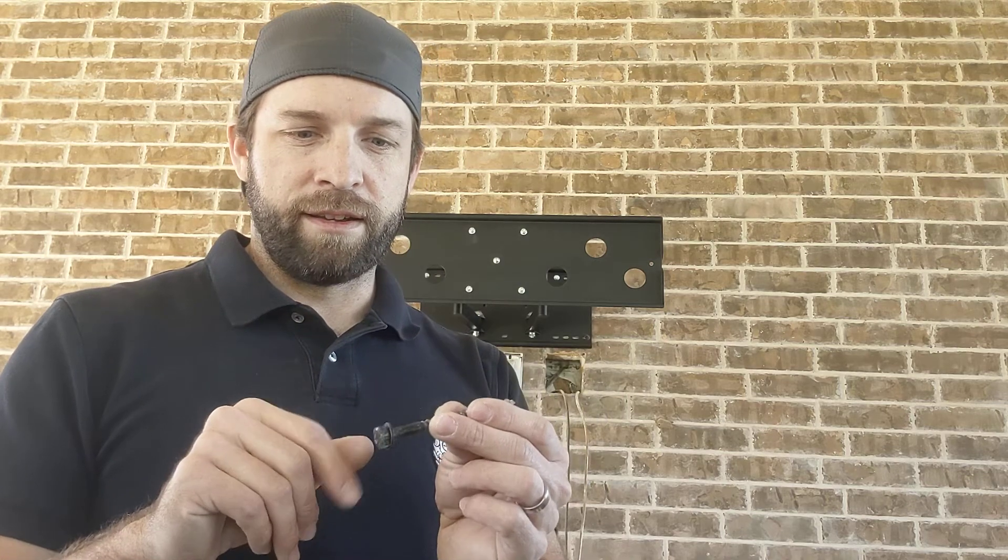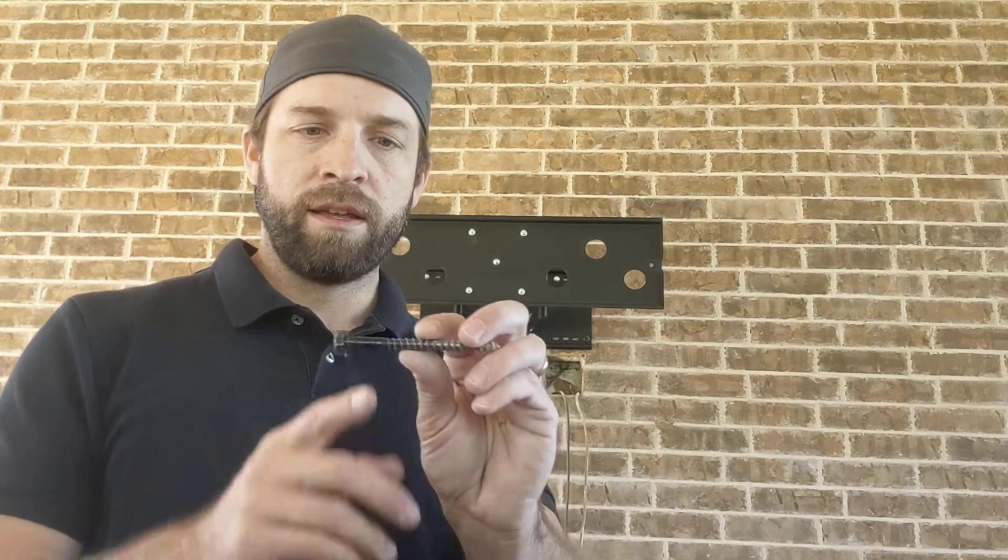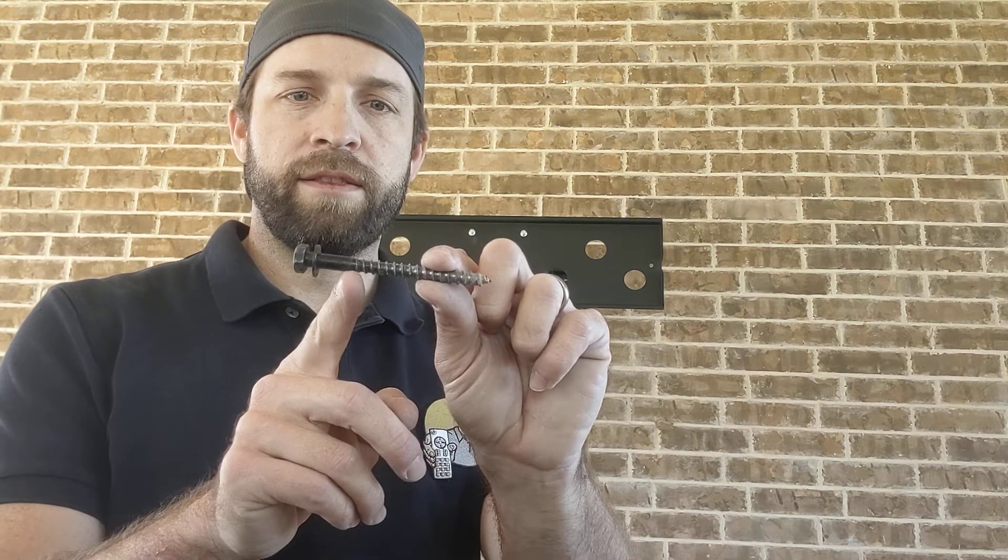That's a pro tip. The TV will never come down if you're attached to that wall behind. One thing to be careful of: don't over-tighten that lag — you will literally pull the bricks through to that wall. You just want them to be barely touching. You want that mount to be touching the brick. Get your lag, tighten it up, just make it touch the mount and the brick. Don't keep going because it will pull that brick to the wall behind. Once it's attached and touching the mount and touching the brick, this part will be in the stud and this part will be in the brick — it will be that shear weight, that's what we want. And it won't pull out because you're attached to that wall behind.